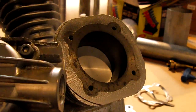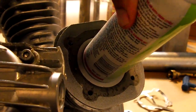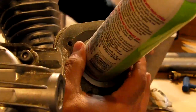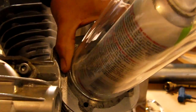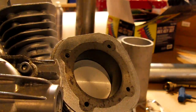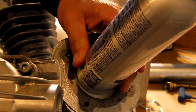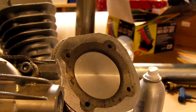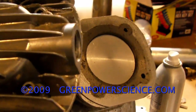So what I've done is come up with a few different concepts, possibly taking a can like this and attaching it to the piston, and what we're going to do is jacket this with a piece of pipe like this. If you looked into the interior — I'm going to use this glass cylinder as an example — when the piston goes down, your displacer piston is going to be over here. There's going to be a little bit of space depending on the size of can you use around the outer portion of this piston. The closer you can get it the better, because you're going to have less air. Your casing out here should be a little bit larger than this.